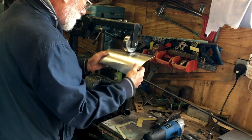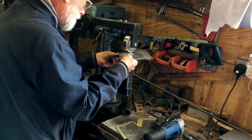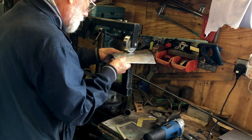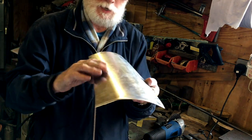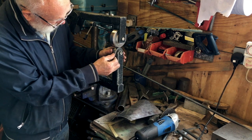Terry designed and constructed this hefty bit of kit, an English wheel. There's a very strong frame and 2 ball bearing races, one with a parallel surface, one with a radius. And you would start to form a dome. This has not been annealed, so it's quite hard. Yeah. That's a pressure wheel, and this is the former, which does the stretching.